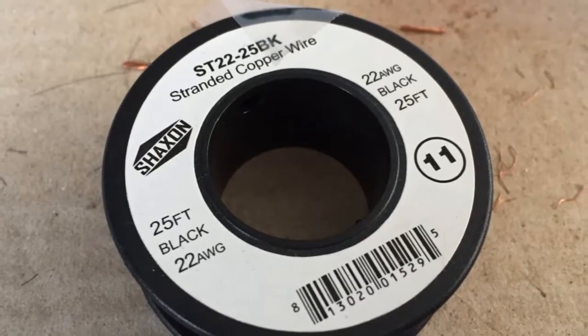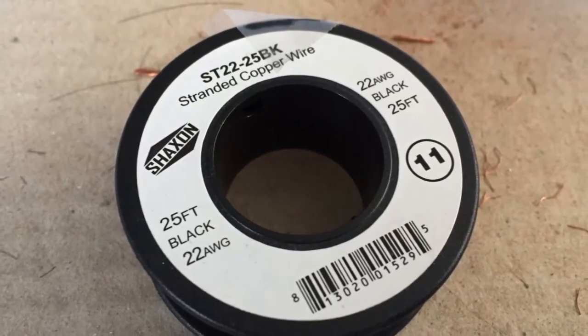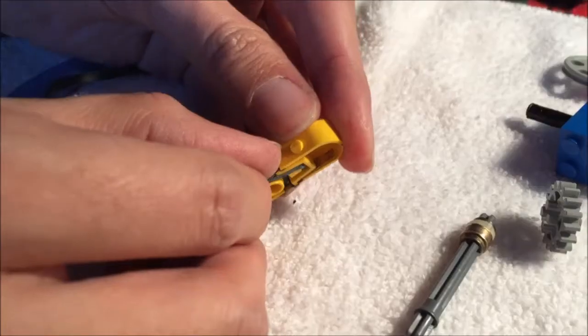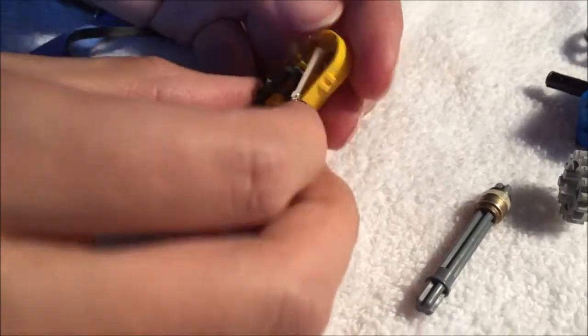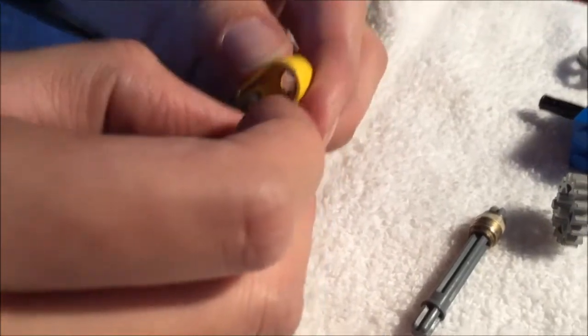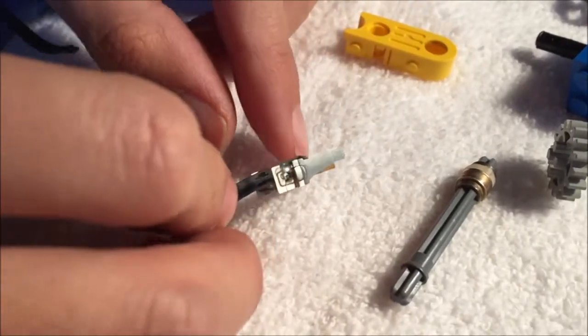As with the 5306B repair, we used 22 gauge braided wire, though you could probably use something slightly thinner. We cut the replacement cables a fair bit longer than the factory cable to give us some room to mess up and to simply have a longer cable. This should not affect performance given how the sensor works.